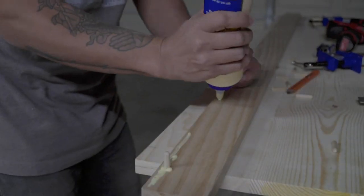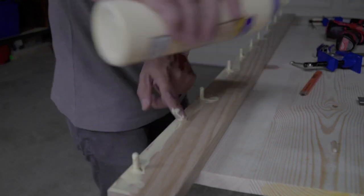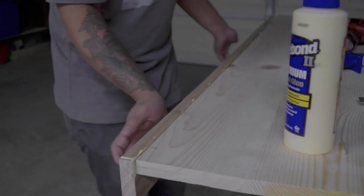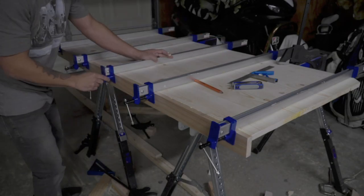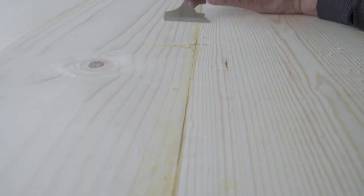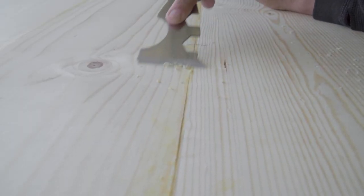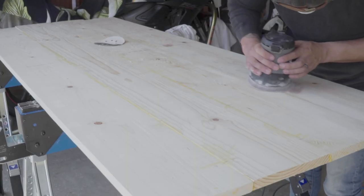For the front face of the desk I used a one-by-two-and-a-half piece to cover the front edge. This piece covers the frame that the desk will get mounted to and adds a bit of depth to the desk. Again, I wish I had more clamps. Once the glue dried overnight, I scraped off the glue squeeze-out, and whatever excess I couldn't get with the scraper I went over with an orbital sander.